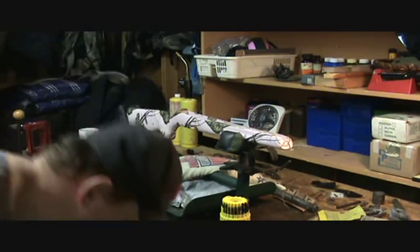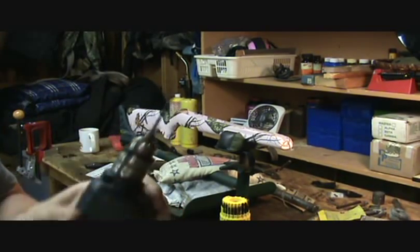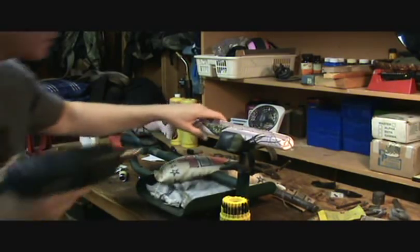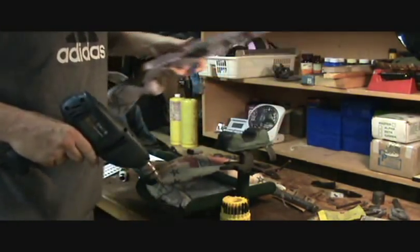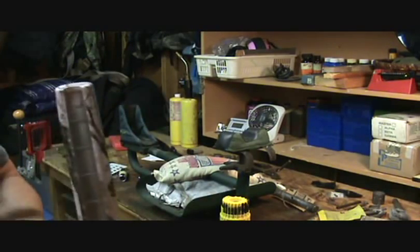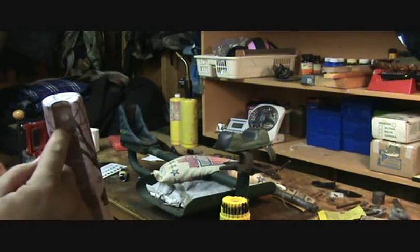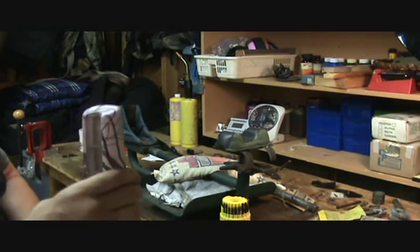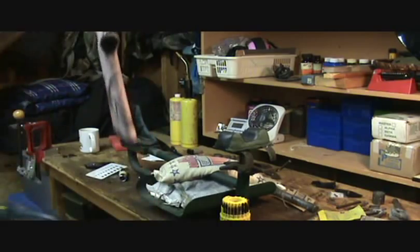The other thing I like to do when I first start these holes is use a much smaller drill bit than I need, so I have plenty of room to move around to make sure I've got the angle going in straight. I'll actually do my starter holes from inside on this pillar, so I can use that pillar point straight up and down as a guide to make sure my drill is going in straight up and down.